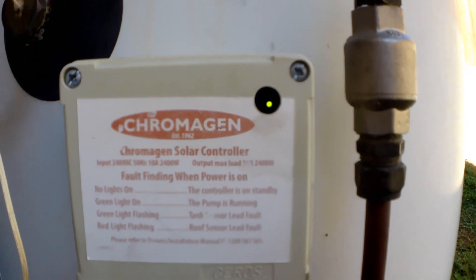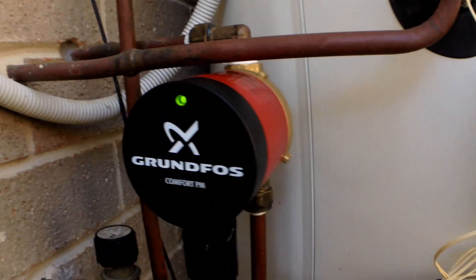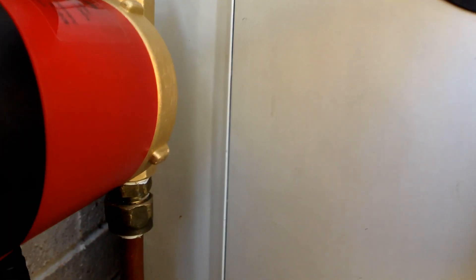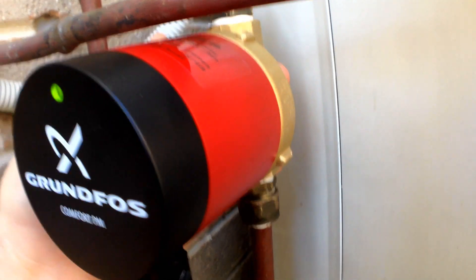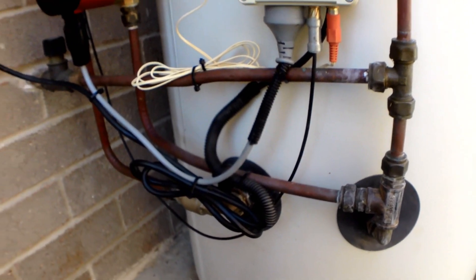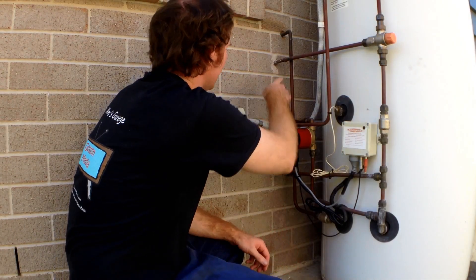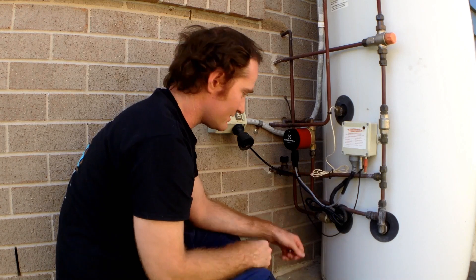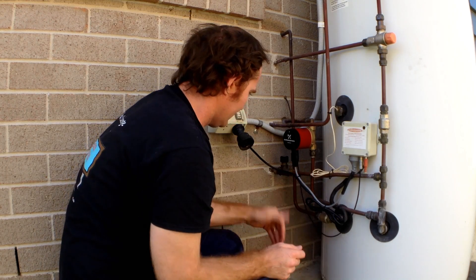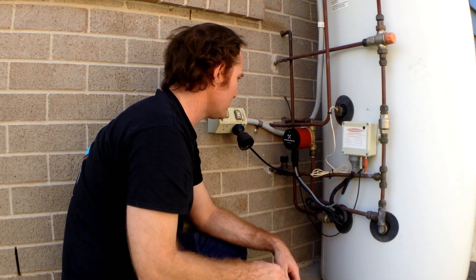So you can see the green light on the controller there — that means that the water's hot enough on the roof for it to circulate and the pump's running. Nice and quiet, nice and smooth. You'll see also I tidied up all the wiring and insulated it better than it was before. Now if the system's working, this inlet pipe here — the return line from the roof back into the tank — should get warm. Yeah, it is — it's very hot, so the system's working great. The pump's running now. As it fills the glass box on the roof with new water it'll turn the system off again and it'll just sit up there to heat up again.